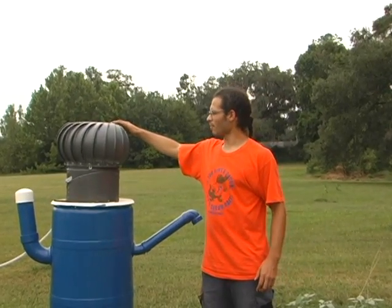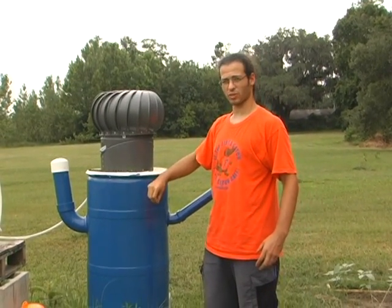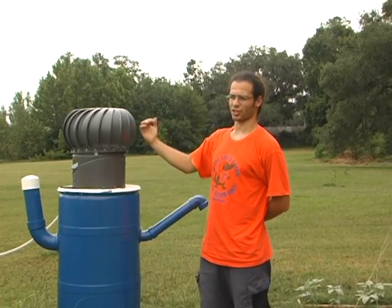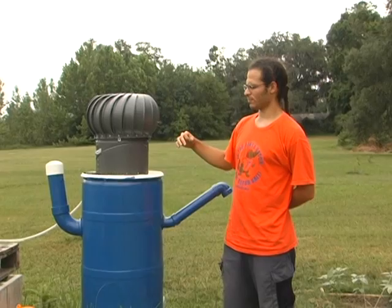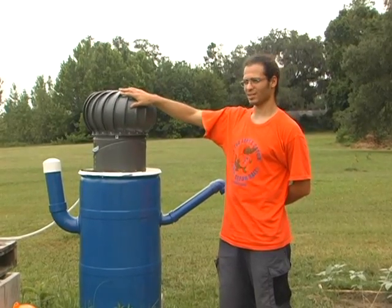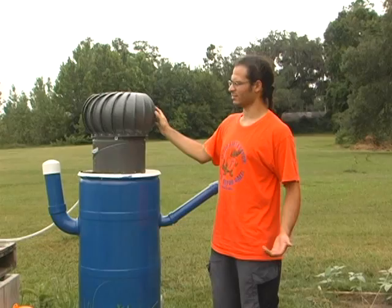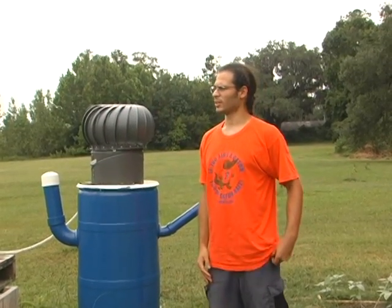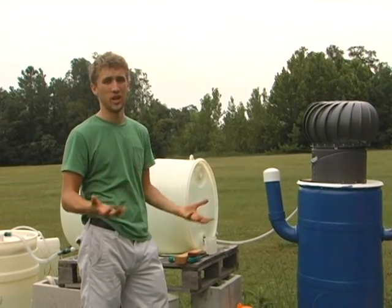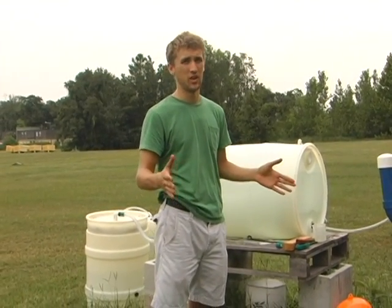This is our stirrer. By moving this handle, a rod that goes into the digester spins around, allowing larger particles to be re-suspended in the fluid so they can be digested and broken down further. We're hoping to eventually use wind to stir it intermittently so it can be more self-sustained with less manual input. Right now it doesn't catch enough wind, so our plan is to extend the fins horizontally to catch more wind and turn on their own. Stirring increases the rate of microbial activity and distributes nutrients and organic matter — it doesn't increase the total amount of biogas made, but it increases the rate at which it's made.